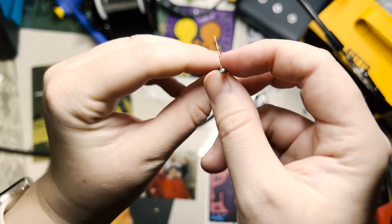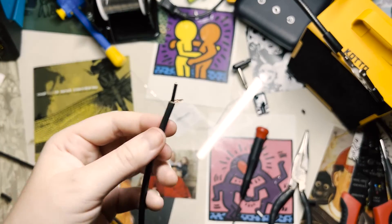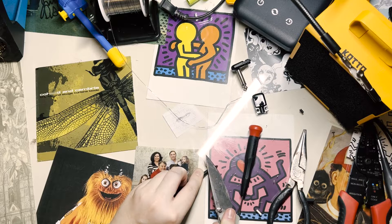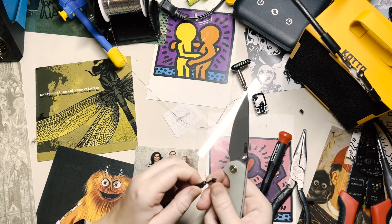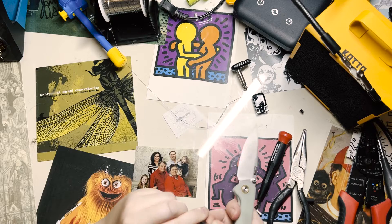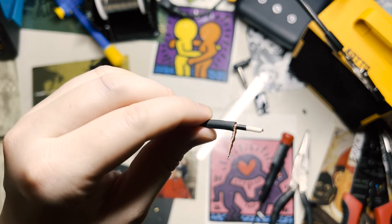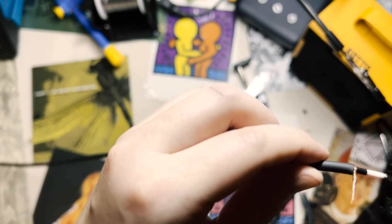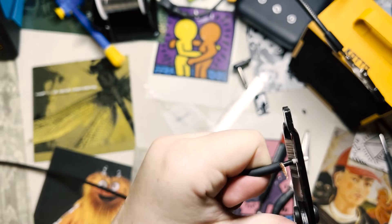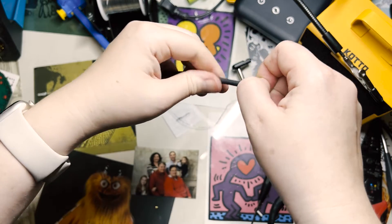Next we get to the inner wire. This BTPA cable actually has an additional sleeve — a very thin woven black plastic. I like to strip most of this down, but I leave a little bit to isolate the tip connection. Do not strip this conductive shielding past the shielding wire. Take the knife and, like peeling an apple, very gently slice some of it off, then unwrap the rest. The next thing we need to do is strip the white casing off of the inner conductor wire — I use wire strippers for this and take off about half a centimeter. Then we're going to twist the conductor wire together, which makes tinning the wire much easier.